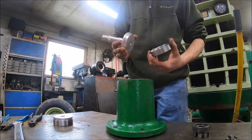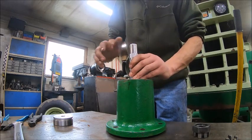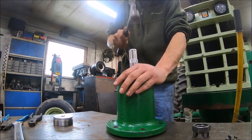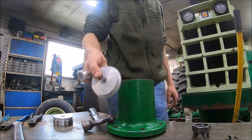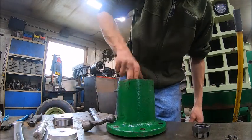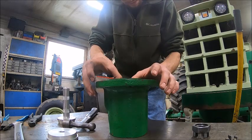driving parts back in. So, got the outer bearing race and then a bearing driver that matches it. And notice, bearing drivers are made out of aluminum. That way, if you bark anything up, you bark up the aluminum bearing driver, not the precision machined bearing race. That one's kind of fun to get down in there.